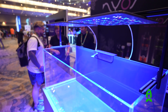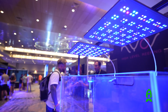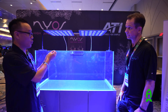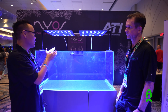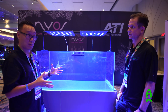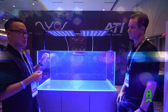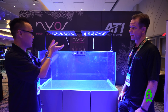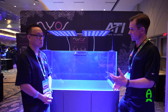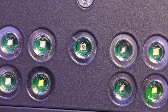That's done a couple of things: it's given people that additional blue look they really crave, and it's increased the efficiency because the blue LEDs are a little more efficient than some of the LEDs that were taken away. So by removing white and UV diodes and adding the new blues, you're actually getting more PAR — not losing any. Something like UV doesn't have a whole lot of PAR output, so replacing UV with blue increases your PAR. The Gen 2 is about 6% more efficient than the Gen 1, just because of the change to more of the blue spectrum LEDs.